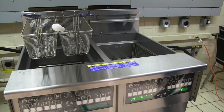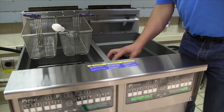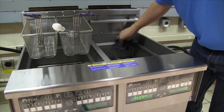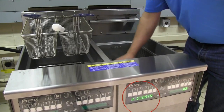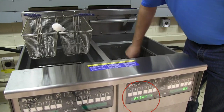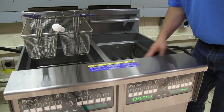After a short amount of time the motor will activate and the pump will circulate oil from the filter pan to the vat. Use a non-abrasive pad or rag to clean the vat while the oil is recirculated. Do not leave any tools or accessories in the drain. A warning will beep and scroll across the display alerting you to when the drain is closing. Remove any tools from the drain at this time.